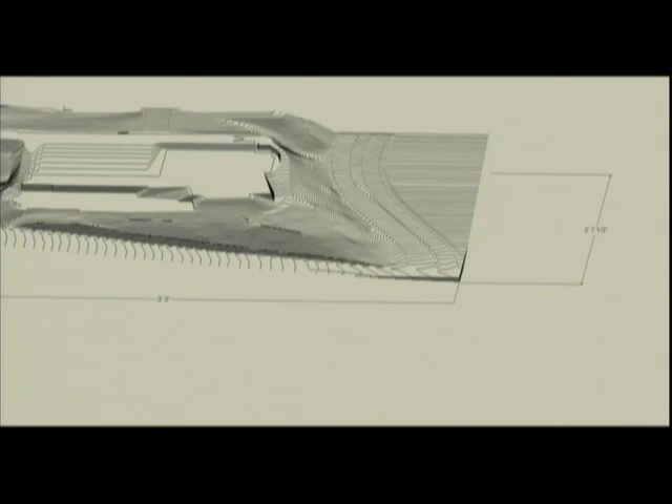I don't always do my tool pathing in SketchUp — tool pathing is taking a design and converting it into a cut file the machine can understand. For this architectural model project I used SketchUp Ruby scripts to do the tool pathing. The model was about 3 feet by 3 feet by 2.5 feet, with each layer 0.05 inches thick. They needed it in three days. I milled the contours out of sheets of material, layered them up, and included registration holes so they'd go together accurately.